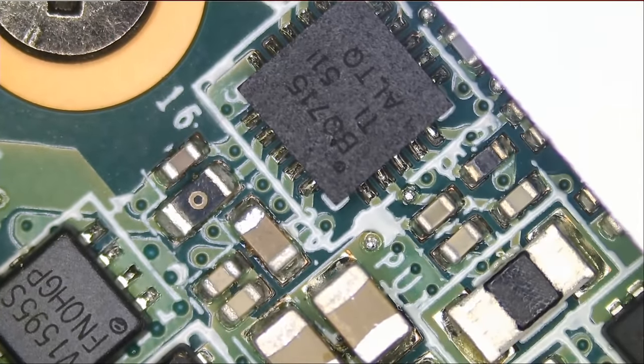Big Boss reassembled the board and it's a no-go. I noticed that this capacitor is now shorting to ground again — those two MOSFETs have gone bad again. We did resolve the short by replacing those two MOSFETs, but after he plugged the charging cable in, they went bad again. We do not have a circuit diagram or board diagram for this board. I've already spent enough time on this — it's turning out to be a rabbit hole. I cannot afford to spend the whole day working on one board; it's not efficient or economical. We're going to deem this repair a no fix and mail it back to the customer. I hope you enjoyed the video — don't forget to like and subscribe.